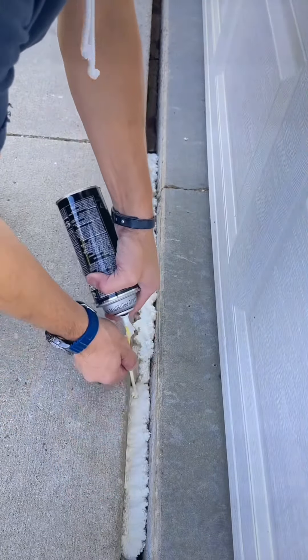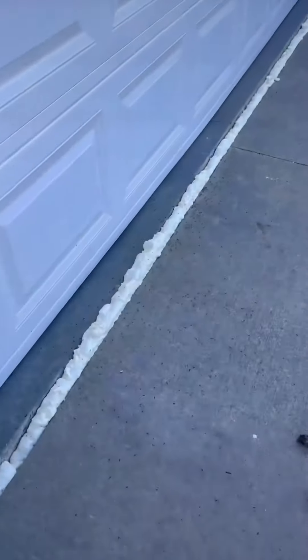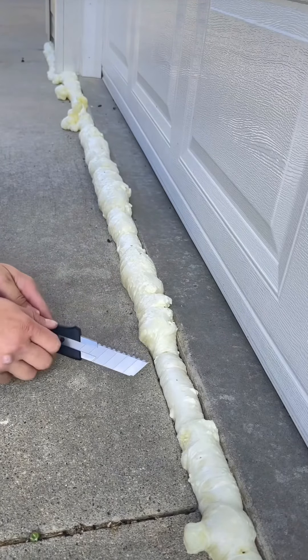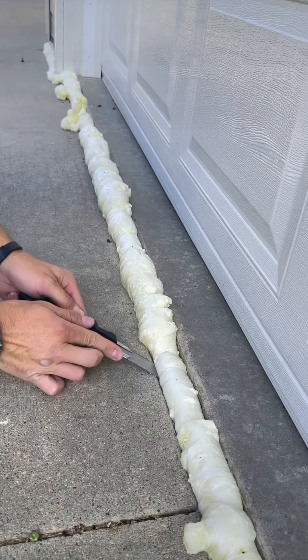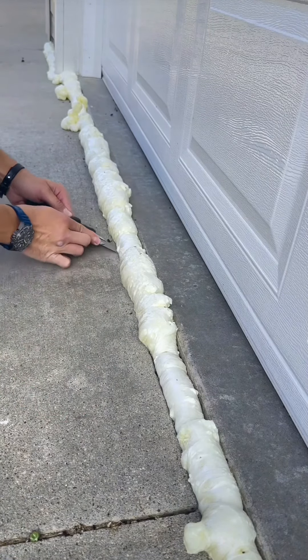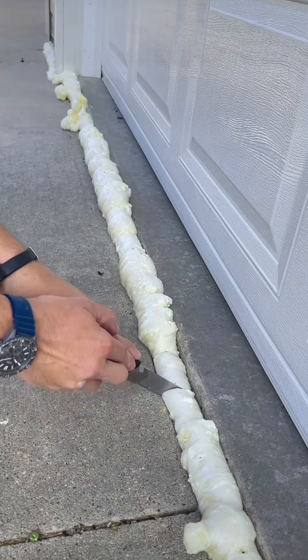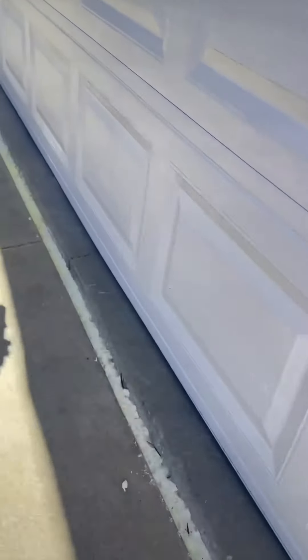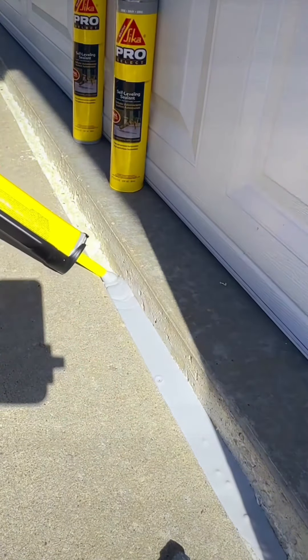There are literally dozens of options to fill this void — you can use a two-by-four, a backer rod, or like me, you can use expandable foam. That's going to take a little bit to set up, so let that dry. Then I'm simply going to cut it out just below grade, essentially making a nice comfy bed for this caulking to sit in. I know there's a comment already saying the best way to fix it is to put a new slab there — we're definitely not going to be installing a new $15,000 driveway. And this caulking I'm using is actually self-leveling, so you just got to get it closed.